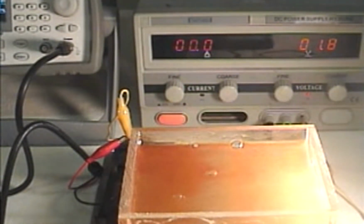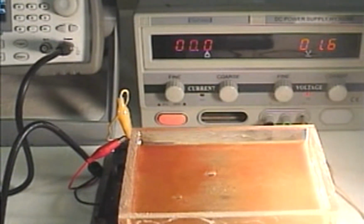So what we can show here is that 7.7 volts directly into the tank pulls over 15, almost 16 amps, and through trimming this with a transistor and setting the perfect resonant frequency, we can zero out the amperage at the same voltage. So now our mission is to take this reflective energy and return it back to the system, and that's going to be where the trick lies. That'll conclude our demonstration for now.